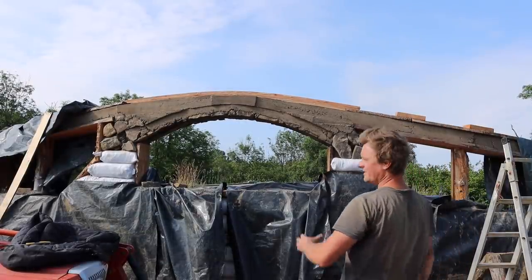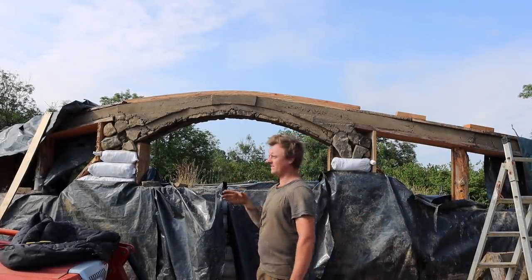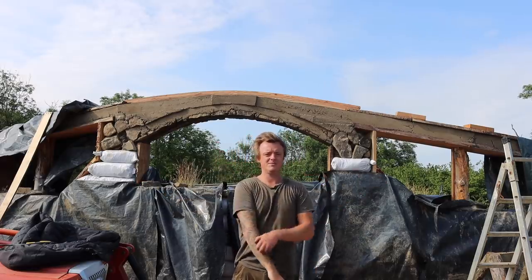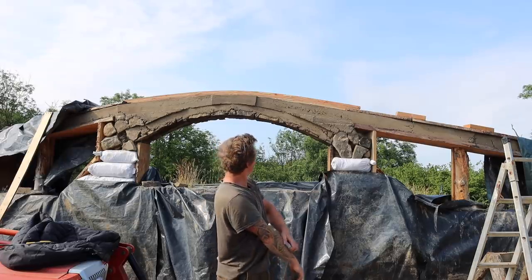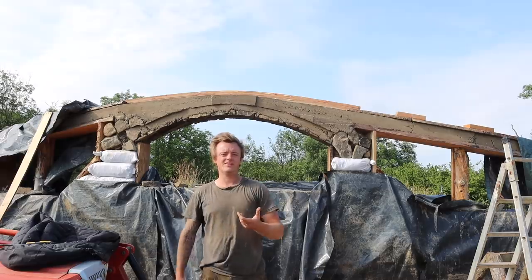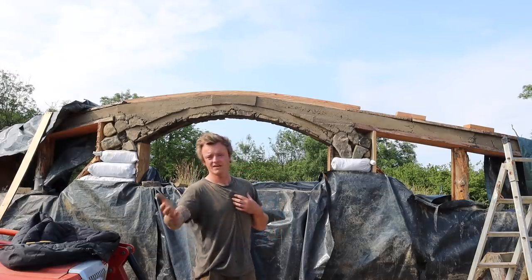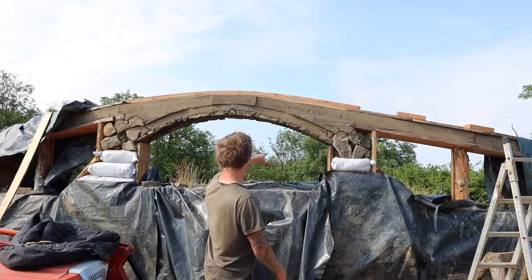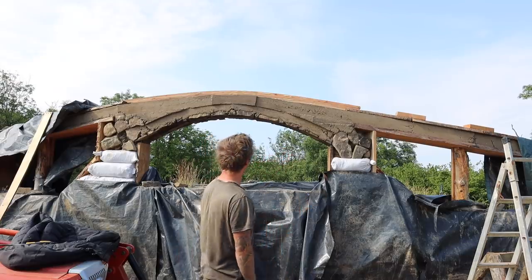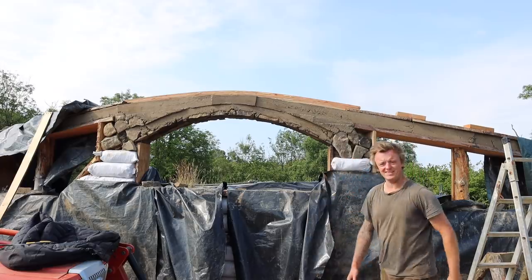Right, so we don't have to worry about the roof log that sits on it, even though there's only one, because that's gonna be putting its weight on the glue lam board, which is actually above the top of that lintel. So it's only got to hold itself, and it's not at full strength yet. If it can hold itself and me when it's not at full strength, I'll be happy with it, because I'm also going to be adding a curved piece of wood in there still with the window. So let's see, I'm going to get up there. There's no cracks, I'm going to stand on it.